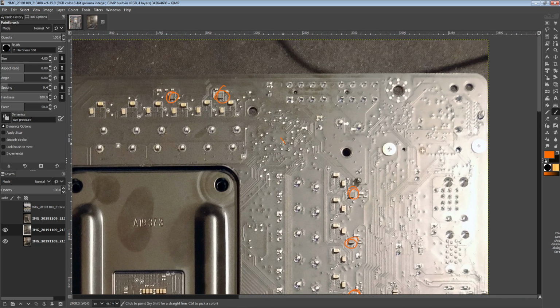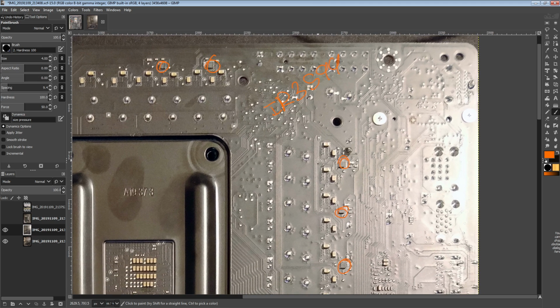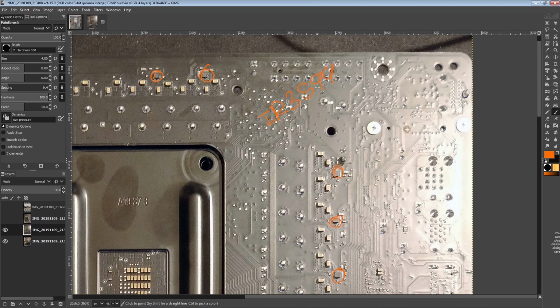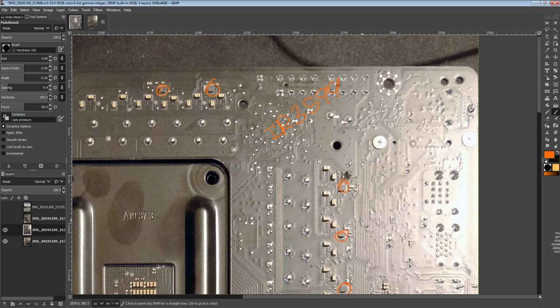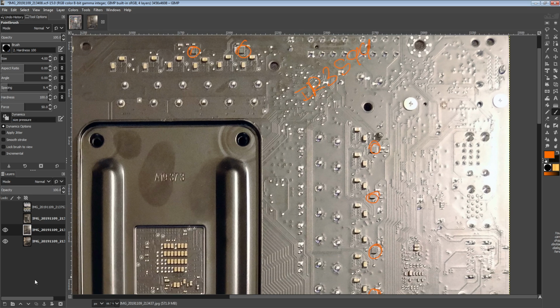But yeah, so these are a bunch of IR3599s from International Rectifier, owned by Infineon. These can double, they can quadruple. They do not integrate any current balancing or any kind of intelligent logic into them. They literally just take your PWM signal and send it to one phase or the other phase, or if you have them in quad mode, they send it between 4 phases, in an alternating pattern, so it automatically becomes out of phase.